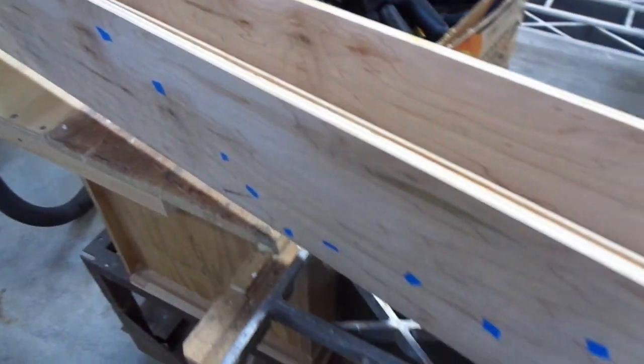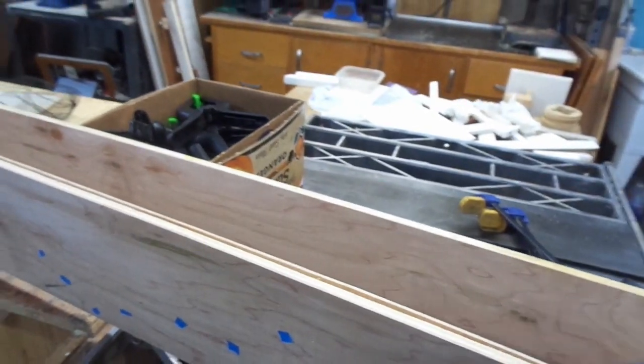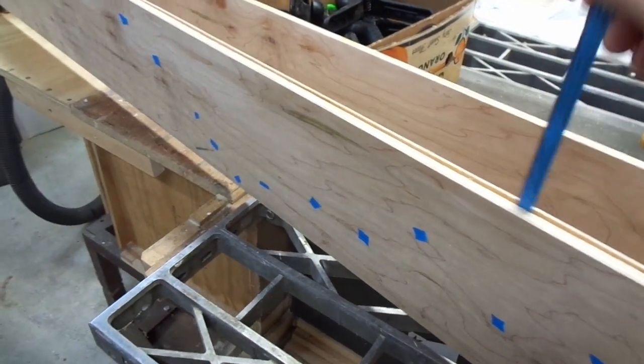And it's a little embarrassing, but I actually have worked on a technique to glue the laminations back together. To get the glue down in the plywood, I'm just using an old hacksaw blade. It's rigid, it's thin, and it gets down.